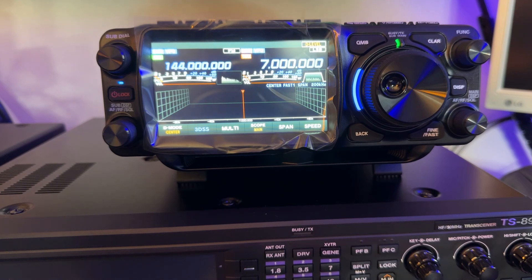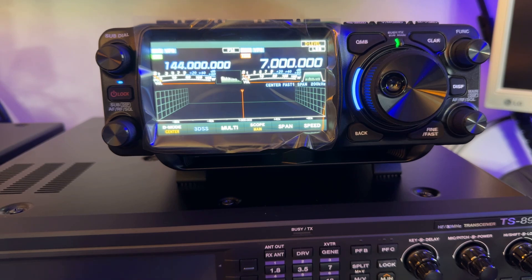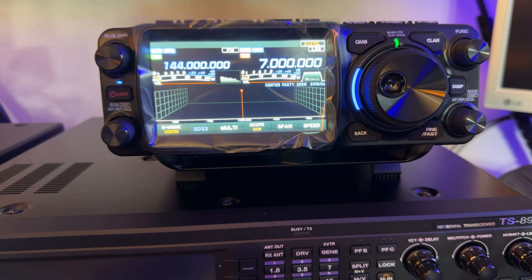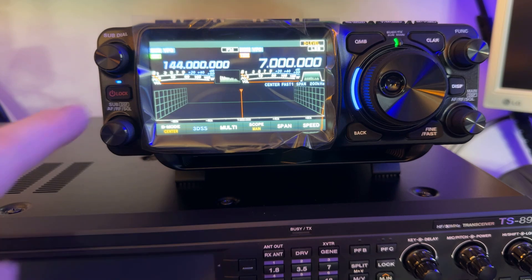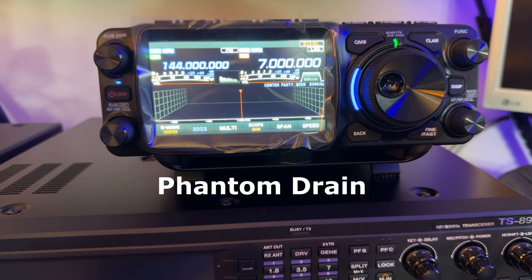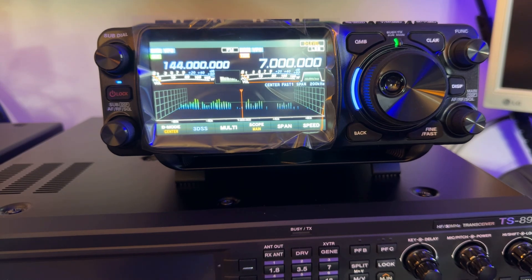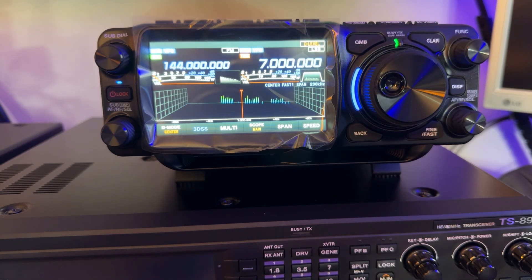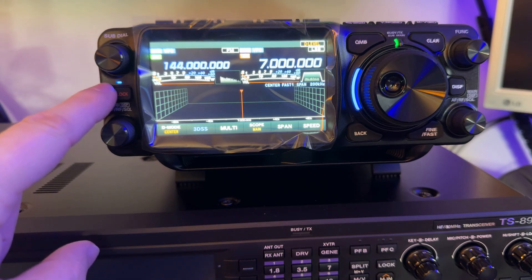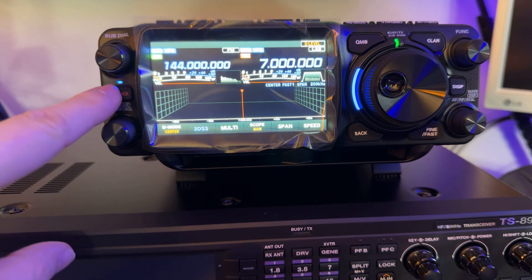We've got HTs out like that now. Here's a bonus tip: I charge my HT and sit it on the bedside table, and a week or two later I come back and turn it on, and I notice the battery has dropped a little bit — maybe a tenth or two or three volts. That's because a lot of HTs — for example the FT3 and FT5, same thing — if the battery's hooked up, a microprocessor is looking for somebody to long press the power button. So there's always a little phantom drain from the battery. I like radios like the FT65 that has an actual click on-off switch — when it's off, it's really off. The FT270, my favorite HT I carry on SOTA outings, same thing: click, it's off. This is a soft-start — you long press. If you tap it, it's lock or unlock, so be careful. It'll lock your VFO. Long press turns it on, long press turns it off.